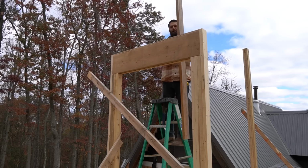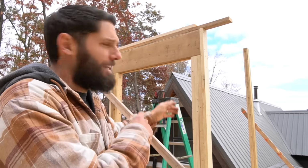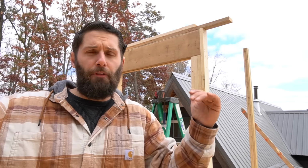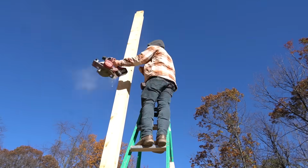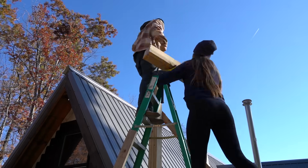The first beam's built. I do have an overhang going across. That's where the wall is gonna tie in, because the wall continues this way and the opposite way. And with that, we're gonna build a new wall and kind of finger them all in place and lock them in place. So now that that's done, we gotta go to the other 2 posts, cut them down to the exact height of that top plate right there, and then we can get the beam on top of that.